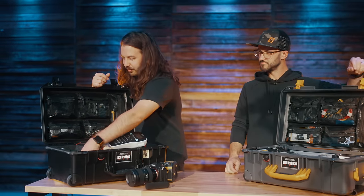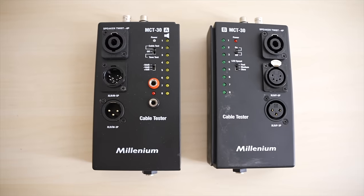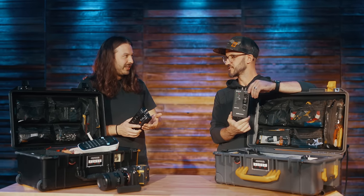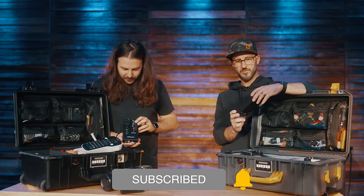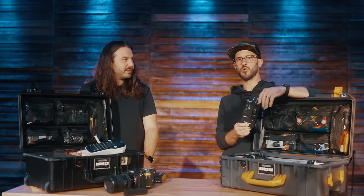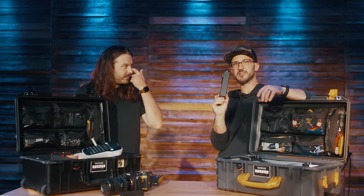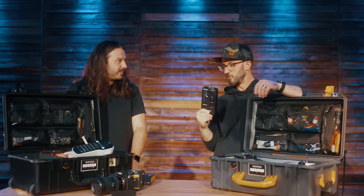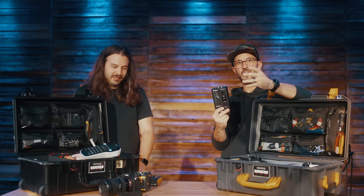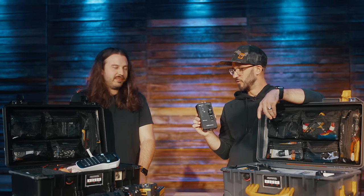Speaking of making sure cables work on both ends — we have this cable tester. The best part is that it comes apart. So if you're running a cable from one side of a room to the other, you can actually test it. The older all-in-one testers were only helpful for patch cables. This is also great for tracing cables in churches that have been around a while with unlabeled runs — send somebody upstairs, plug in one end, and go cable to cable until you find the one that lights up green. Then you label it. These are only about $50 online — link in the description.